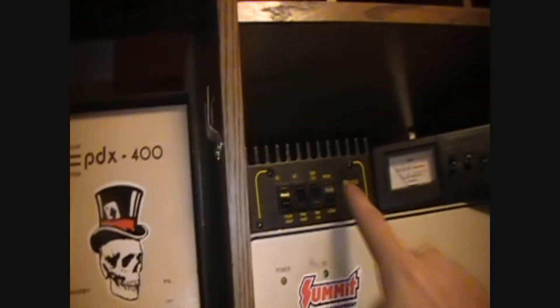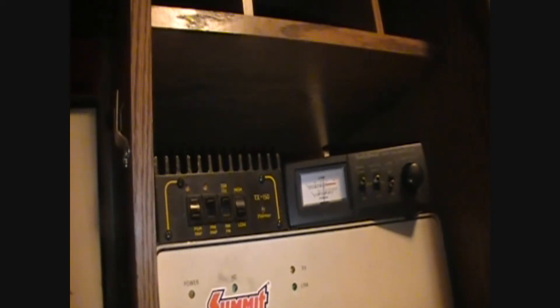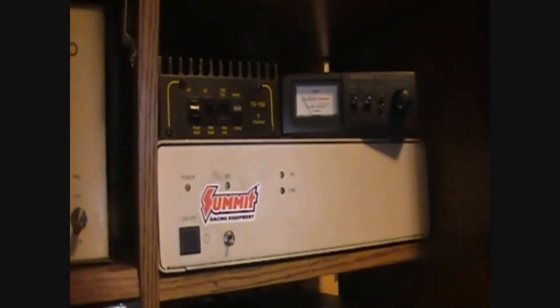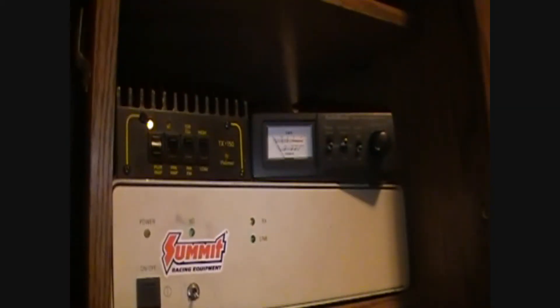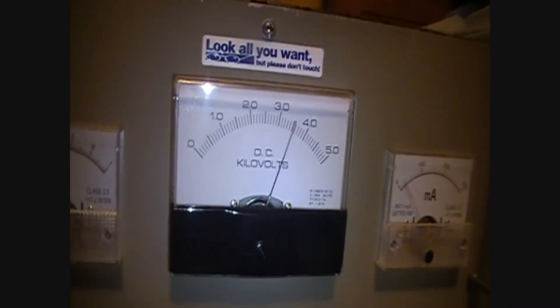Let's pump it up - high power, 75 watts in, 2000 watt scale. It's keying 400 watts there. Let's take it down to 27 - it's keying 500 watts. Plates are a little bit red; that's because of the tuning capacitor. Let's dial it down to about 100 watts. There's 100 watts - 4 kilovolts on the plate. Under load it's only dropping down to 3500 - that ain't bad at all.